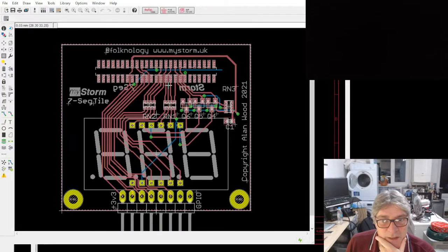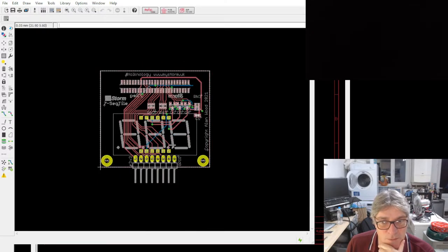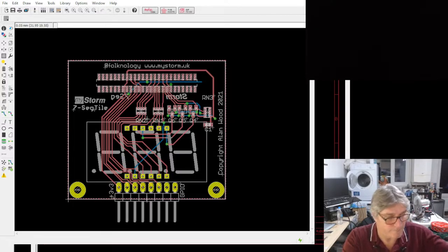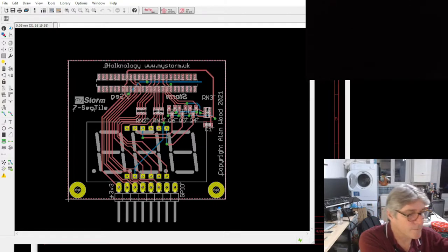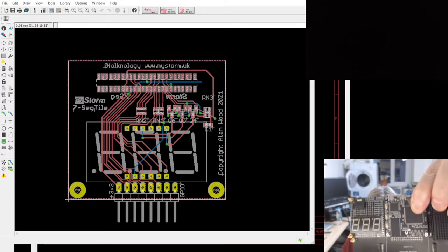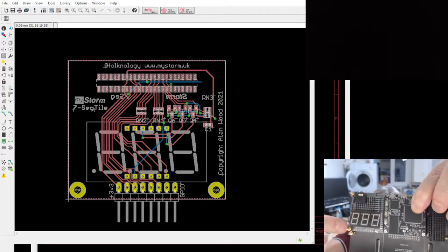The way to view this is we're looking at the surface mount component side, including the connector, which will be faced down to the logic deck itself. And also the header is facing down as well, but it's a right angle one I'm pointing out. The 7-segment display is actually on the other side from what we're looking at through here. So in reality, that will end up on top, much like we have here with the display on top. This one is poppy.